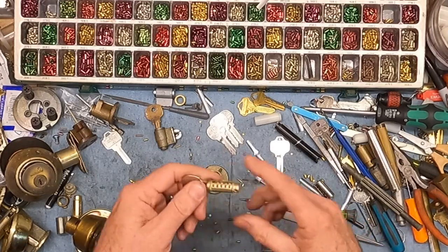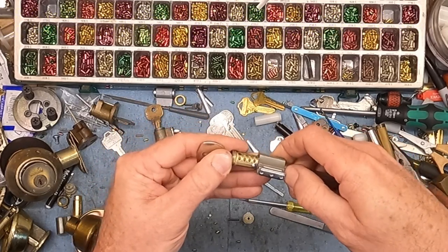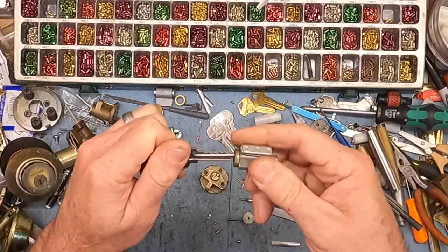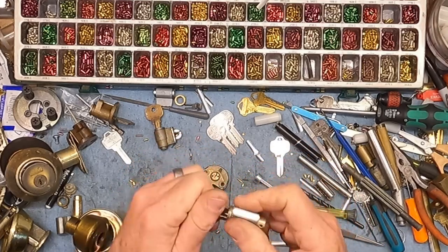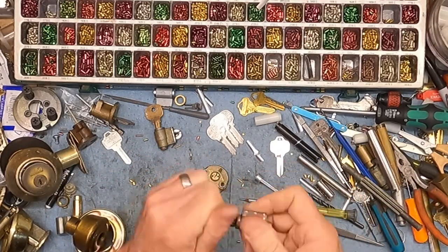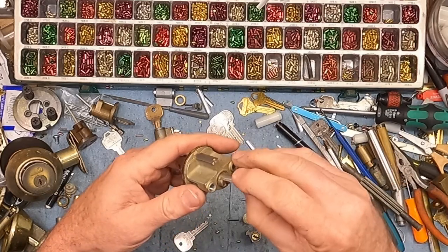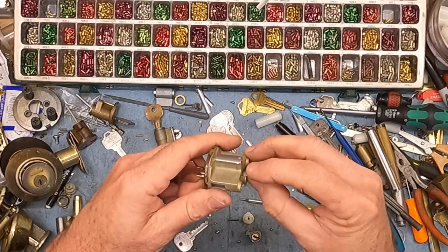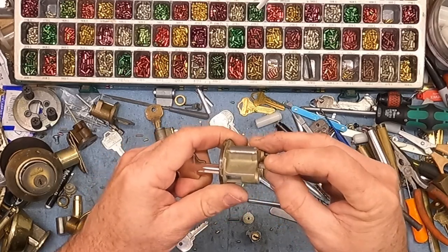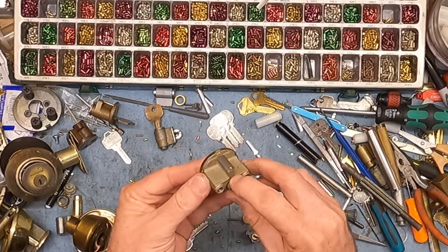Set that aside. I wouldn't normally do that in the field — always finish one lock before starting the other. We're going to bridge the gap and push, pull — there we go. Check it. Now we need to shim our deadbolt — grab that shim. I knew the top pins and springs were okay, but as always, if you're working on this for the first time, check your top pins and springs.